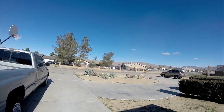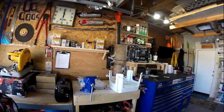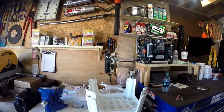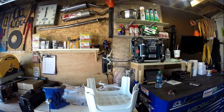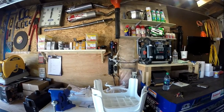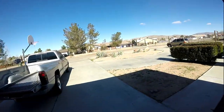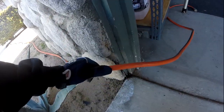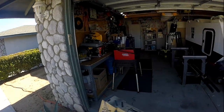The problem I have with the welding, always these challenges, is in this house that I'm renting, these 15 amp plugs. Breakers trip when I try to weld. The weld pops, because it's not getting enough voltage. So I had a buddy of mine install a 20 amp plug out by the spa. Now, I know extension cords aren't the way to go with a welder, but this thing is super beefy. It's very expensive. It's 100 feet.